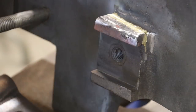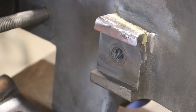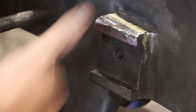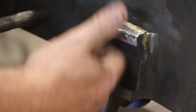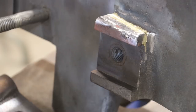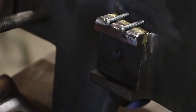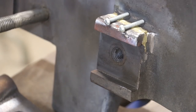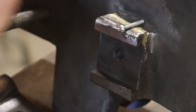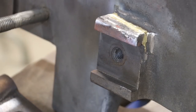Three sides are brazed — one side is still open, and that's a little concerning because that's really where most of the force is going to be when it pushes on the top side pulling up. To counter that and add security, I'm going to drill and tap a couple of holes and put a couple of screws in the top there. That should give us plenty of strength to raise and lower this piece.